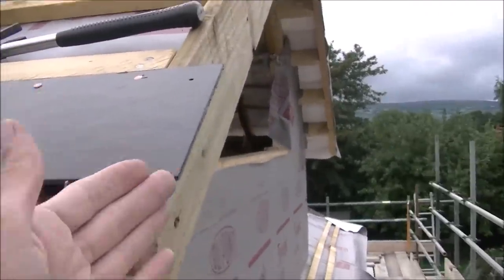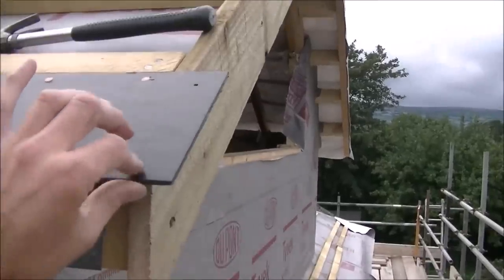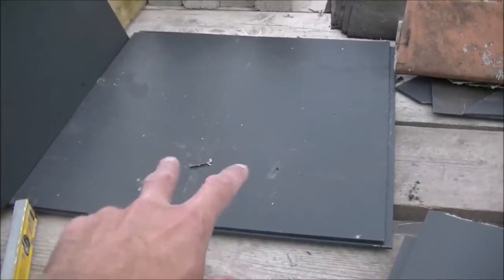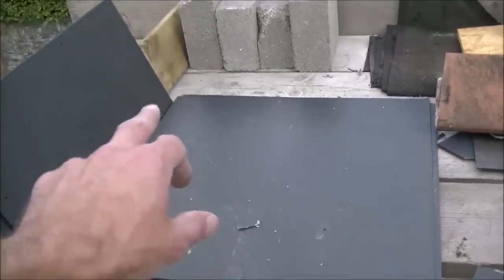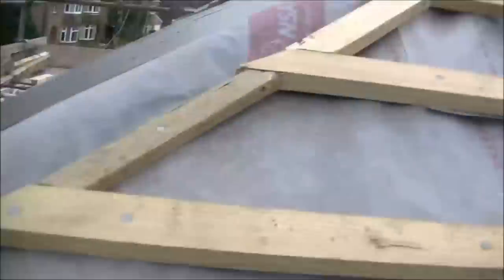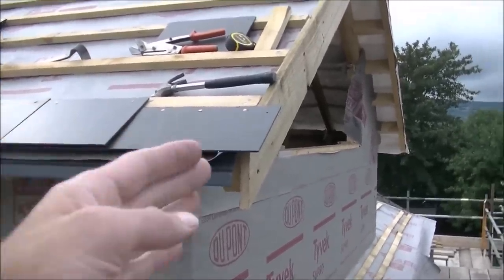Mine is slate and a half plus about an inch. The reason you do this is you can add a few more nails and get more stability on this gable end. That way, when you get high wind and bad weather, you're not going to get these small bits of slate vulnerable to flapping around - you get a lot more stability. This is the double slate. If you look at a standard slate width compared to that, you can see this is twice the size. These come with no pre-drilled holes, so you drill one hole where you normally would and then pop another two in - you get more nails across it, make it more stable.